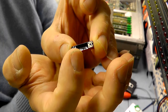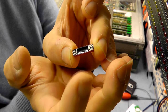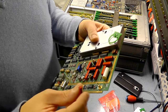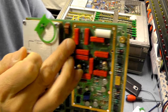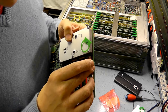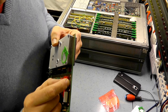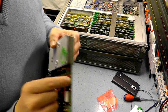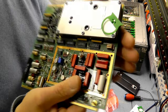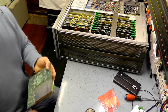This connection on the end is connected to a screen around the relay. On the original relay that came out, there's another connection also connected to the screen — so it doesn't make any difference, they're at the same point anyway. That's going to go back into the board, which comes out to the grounding position we took out last night. So we'll pop that in. It's actually slightly smaller than the original one.